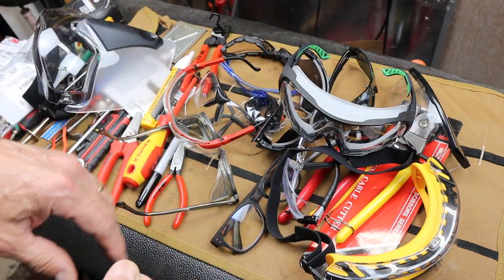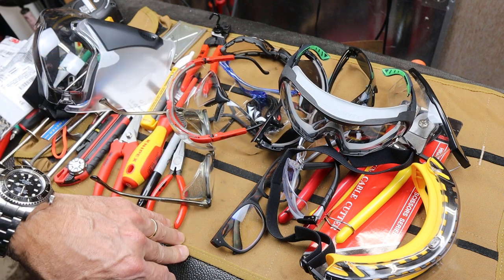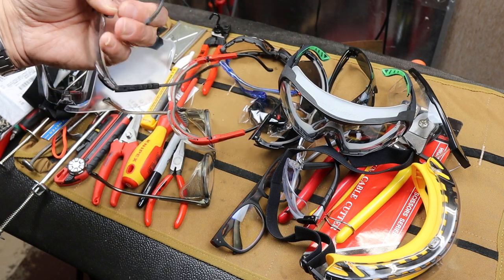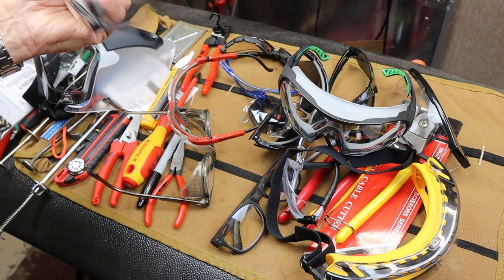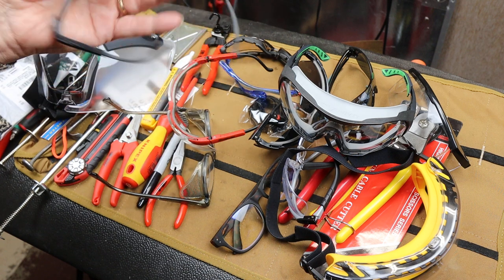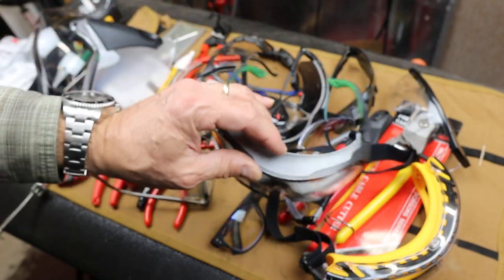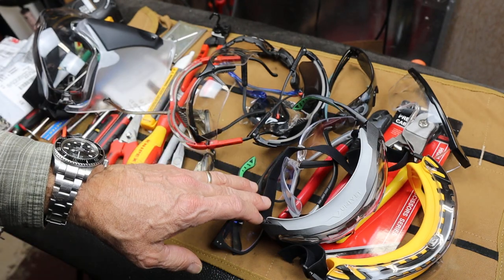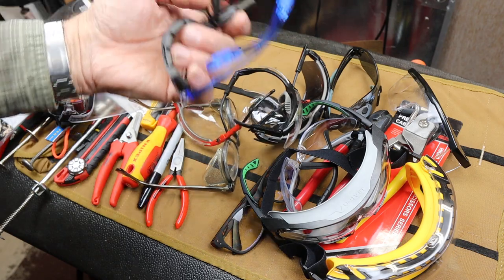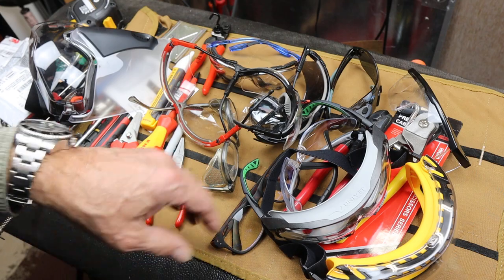So there's some of mine — I have others floating around — but the thing is to have them handy. Have them within reach. If you have to go get them, you probably won't, and then something goes bad on that quick drill or quick hammer strike. These with the softer gaskets are a little bit better around fumes, but they're not really designed for that — they do leak. So don't rely on them if chemical fume protection is really what you need.